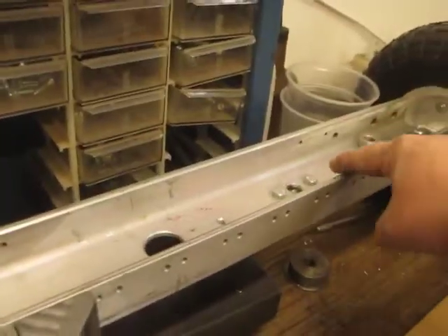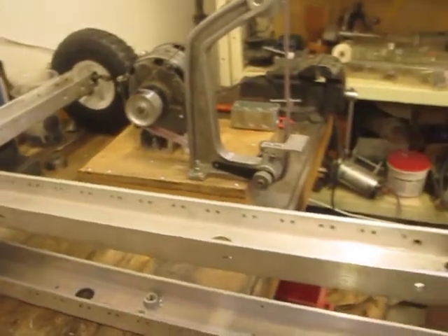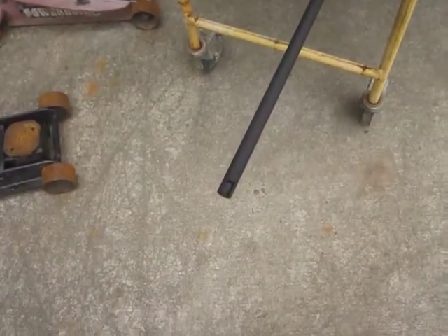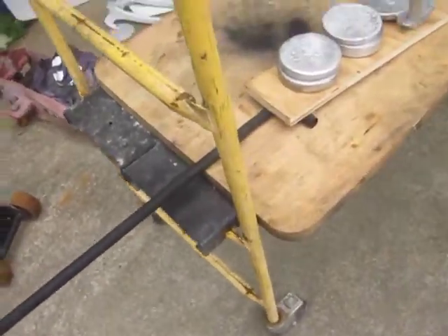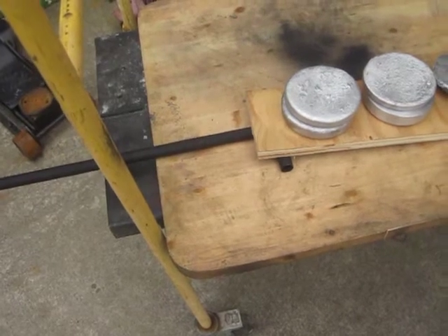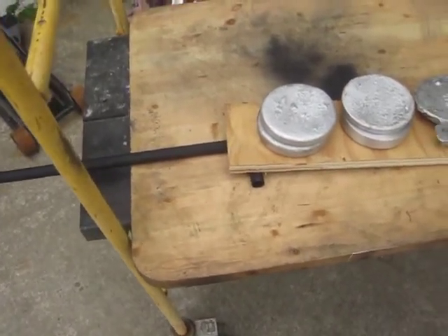There's one in the back on each side. You can see the tie-down there also, one on each side. It's coming real close to being done. I took those galvanized tower brackets off. This is the T-bar steering bar — I took a half-inch piece of conduit and cut a notch in it. I just notched it so that I push it in and turn it and it will lock down. I painted it mostly because I tack welded the handle onto the top, and I wanted to cover up my really ugly welds — because I'm not a welder, more of a hack when it comes to welding. Those aluminum pieces there will be the feet for the leveling jacks, so it will have a wide surface to sit down.